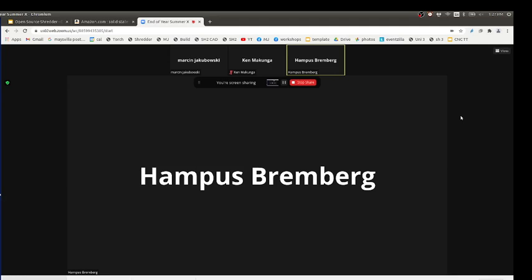Okay, I might have missed it. It's because valves could be single acting. When you go to Surplus Center, you're going to see single acting, double acting. Single acting is where you can only push it in one direction. Then you have plumbing that's related to how each one of them works. We never use single acting, because if you move something one way, you want it to come back, or you want a motor to go both directions. But how do you refer to what I would call a load? Hydraulic cylinders are known as actuators, and motors are motors. So, loads.